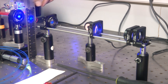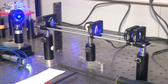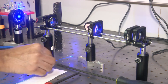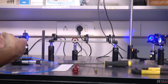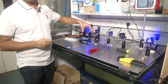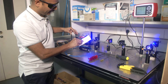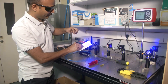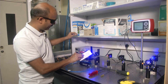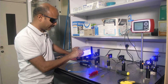This gives you a collimated beam that comes through this lens and then focuses onto the fiber. It is a very common configuration where you are coupling into a fiber end. Many times instead of the fiber end you will have your sample there, measuring emission, scattering, or something associated with it. One useful thing about the card is that when you are wearing the laser goggles you do not see the incoming laser light but you can see the fluorescence originating from the sample.